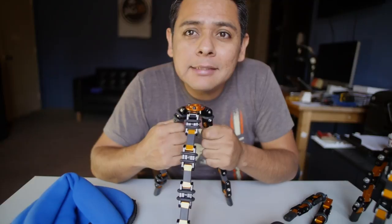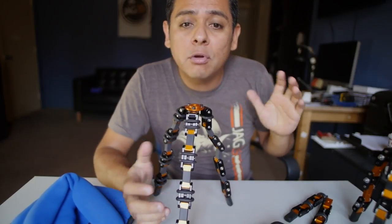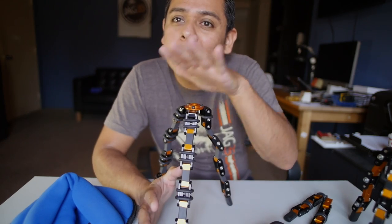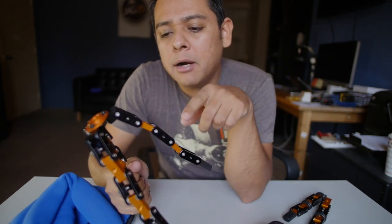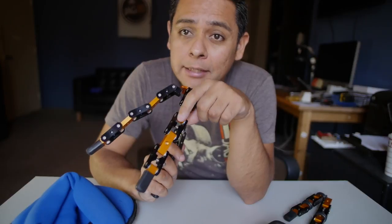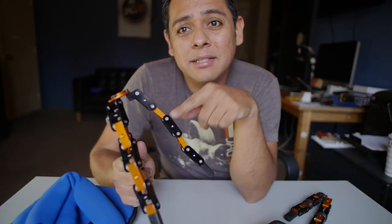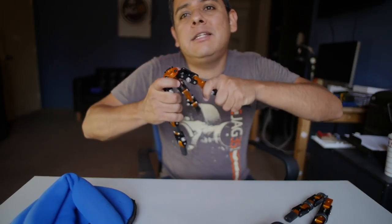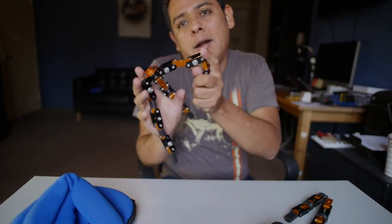So the beauty about this design, of course, is that it's modular. Let's say that you somehow have a really heavy camera that you would like to use on this. You can take your tripod apart and then put metal washers in here, or get rid of the washers and just leave the aluminum to aluminum. Now, it's not going to be really easy to use, right? Because it's really hard to turn these.